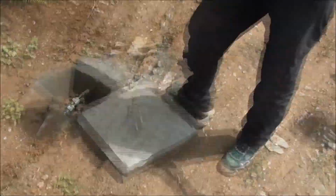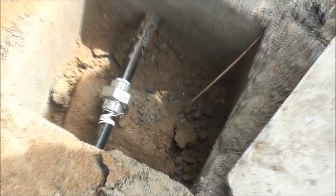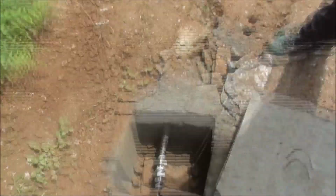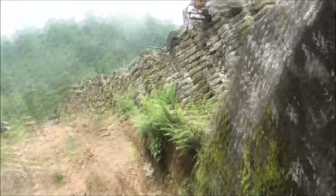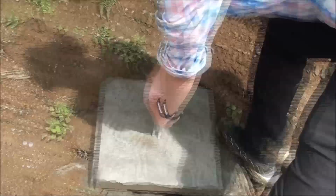Box B. And this here is home to a beautiful 3/4 inch GI union. It is used to replace a rather creative solution before, in which a 20mm was shoved in a 25mm wrapped with a biscuit wrapper. So here we have a GI union, pipe tape, and we protect it from the elements with concrete. Essentially we connected an existing 25mm to a new 25mm that we installed.